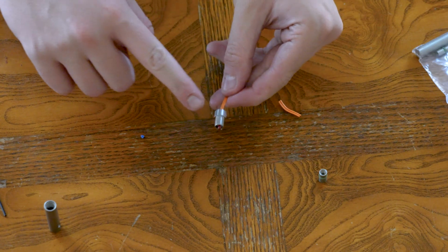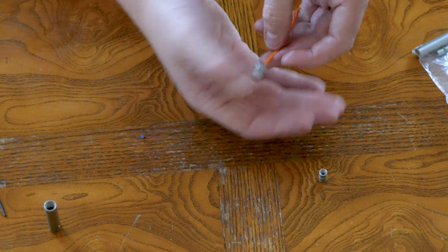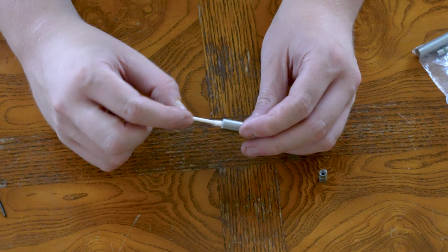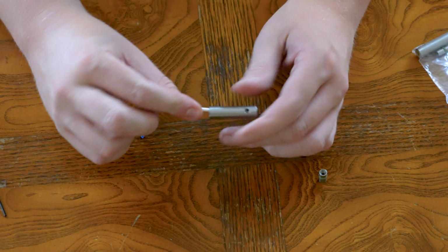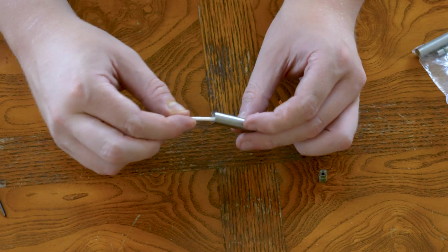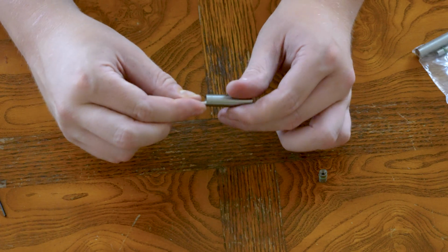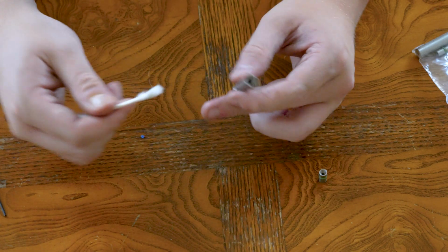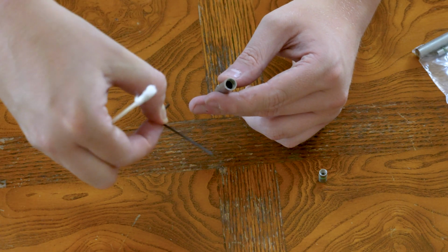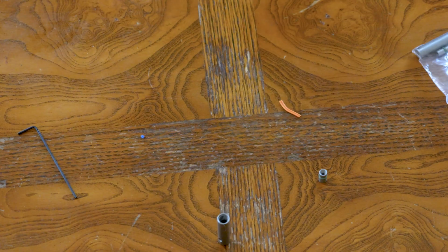Like I said, they really stress making sure that this whole assembly is very well sealed. So I'm just doing my best to adhere to that. Next up, we're going to lubricate the inside of the cutter body using pretty much the same process as we did with the screw. We just want everything nice and slippery in there. You can't see it, but there's an O-ring down there seated at the bottom. They recommend using the included Allen wrench to make sure that that's properly seated. I already did that off camera, sorry.